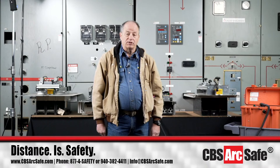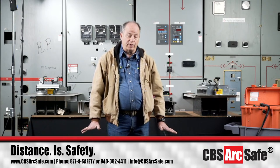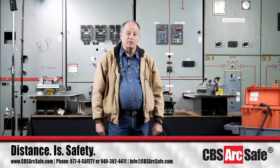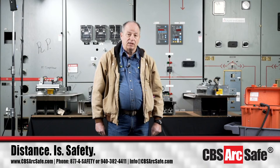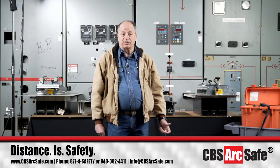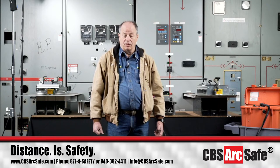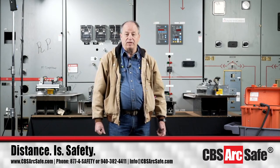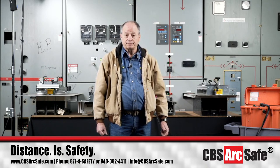And we're going to look at some small ones. Even though we're only showing you five actuators for molded case circuit breakers, the smallest one we've actually done is in a 240-volt enclosure for a small two-pole circuit breaker. And the largest one we've done, you're actually going to get to see today, is on one of the Westinghouse P-frames, is what we call it, the SPCB frame, the large 2,000 to 3,000 amp variety.